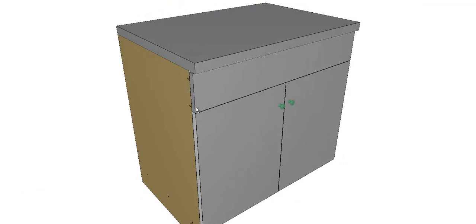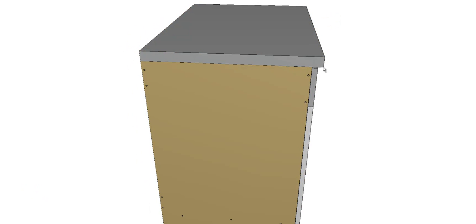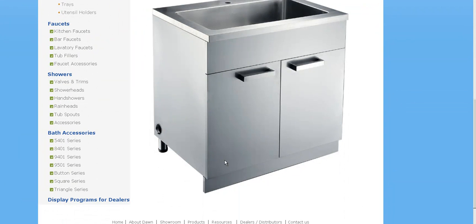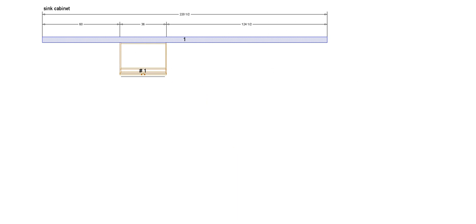I couldn't make the materials the same because we don't do stainless steel cabinets, but I've got something similar for you. It looks like it's got about 1.5 inches overhang from the front of the cabinet case to the front here. Most likely that's what they would be doing. It looks like they're using a standard European style construction, just based off the pictures, very similar to what we do. Of course, their toe kicks can be flush up here, which is a little different. Nonetheless, it's not a big deal. The thickness, it looks like, is about 1.5 inches. So we're going to basically assume that you're going to be running your countertop into the side of this sink top, which will be pretty cool looking.